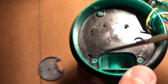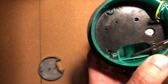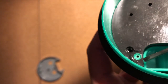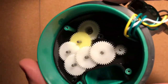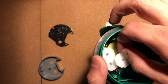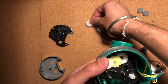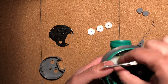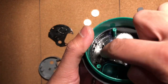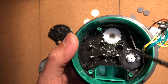As you can see, these three green locations are kind of heat-sealed in. You can just pop them up with a bit of force — as I've already done this one, it won't be too difficult. You can just see a lip there; if you can get your screwdriver in there you should be able to simply pop it. There we go — that exposes the gearing. Pull all the gears out and lay them on the board in the same order they came out — this should make it easier to reassemble. Watch out for these pins; they're quite loose and can come out.